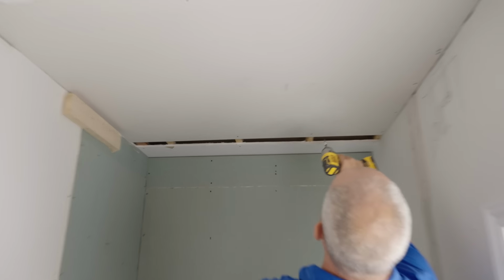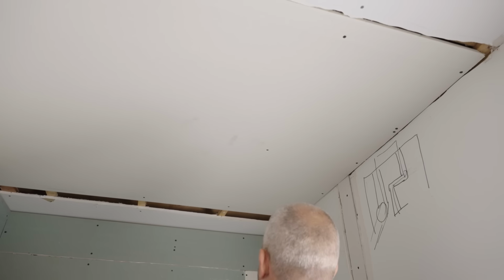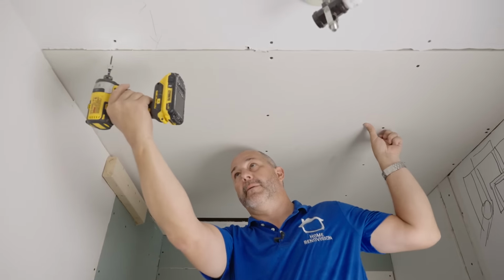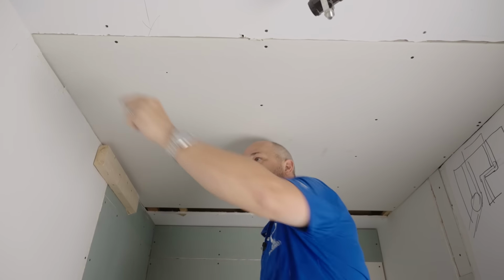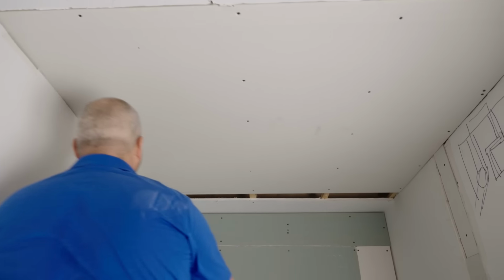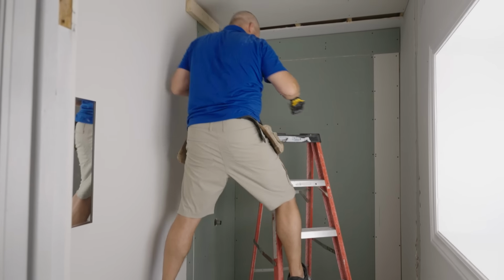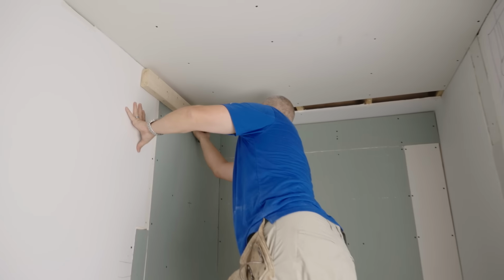You look here, and you can line that up. Middle of the sheet. And then, there we go. This is why when I cut a hole, I always put a drywall screw on the old surface, sorry, because it tells me exactly where my strapping is once the sheet is closed. And yes, you can use a toilet as a place to stand. Now, get rid of my extra pair of hands that I got over here.